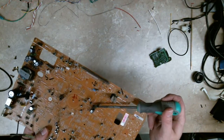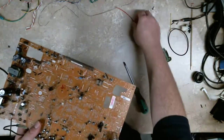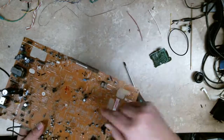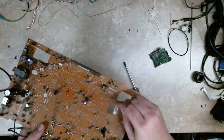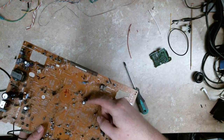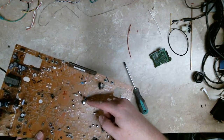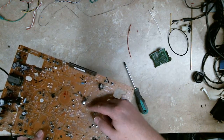So that's what they do here. They put two identical diodes across from each other, and then there's little plastic bits, and when they interrupt the signal, or interrupt the one transmitting, you lose your voltage. Let's see, the photons coming from one hit the diode junction of the other LED, and that produces a voltage out of the pin.